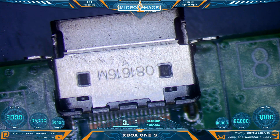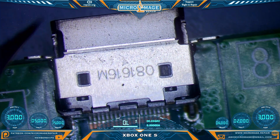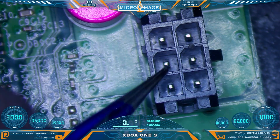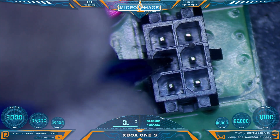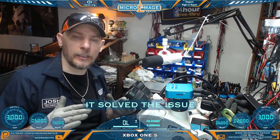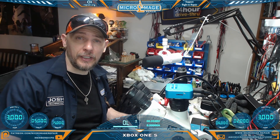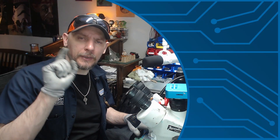To explain in a little more detail: I put one high-voltage probe on a connector ground shield — all of that is ground — and placed another probe on one of our shorted pins to inject voltage. That's all I really had to show you; I just wanted to go over voltage injection a little bit. I don't have the whole console to show you the final result. If you found value in this video I think you'll find value in the next one, and I'll see you there.